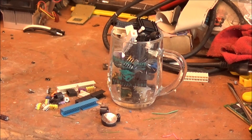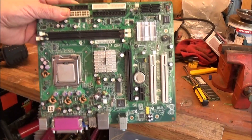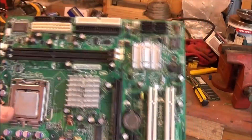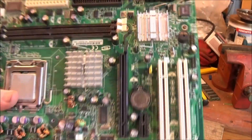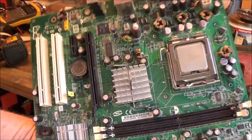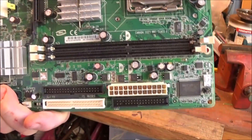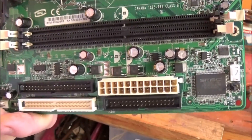What is the secret to getting these out in a sane and efficient manner? A paint stripper gun. I'll show you how it works. This is one of a number of old motherboards that I have. It's getting ready to be sent to recycle, but before I send it to recycle, I'd like to get some of these parts off — like the button battery holder, some of these connectors, and so forth. But it would be insane to try to sit here with solder wick or solder sucker and try to get these out. This is a double-sided board — it would be extremely difficult and time consuming. What if you could get this whole connector out, or this power connector, at one shot? You'd probably be spending a couple hours and a few dollars worth of solder wick. I'm going to show you the easy way to strip parts out of old motherboards, since it's going to recycle anyway.